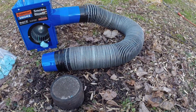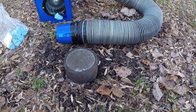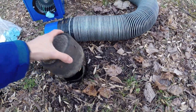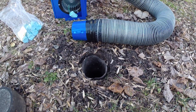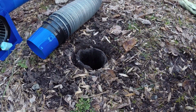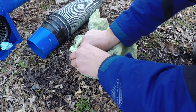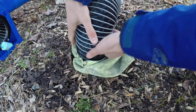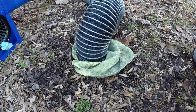Here you have your 8-foot flexible hose. We have a clean-out cap halfway between the septic system and the house, and that's a perfect access point. Really, this works with any access point. So we're going to pull that off. We do have a slightly damaged pipe here, so I'm going to use a rag to give this a better seal. I'm just going to place this rag around the edge here where it's cracked, and then stick in the 5E tube right here. And that should help give us a slightly better seal. So now we're all set.